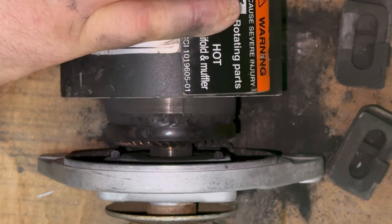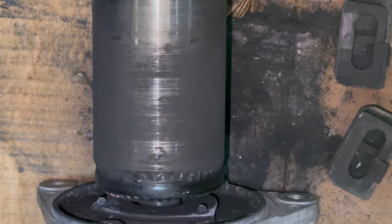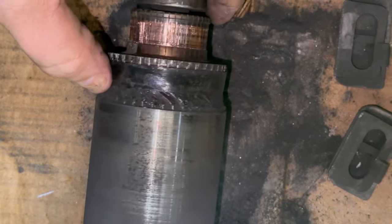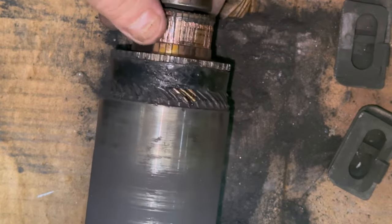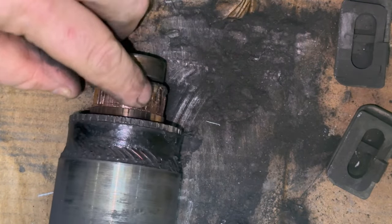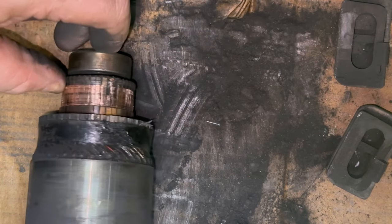Oh yeah. Oh yeah, she's toasty. Look at all that melted windings. I put an adjustable wrench on here to try to hold this pulley earlier, but the reason that these armatures fail is it starts getting hot and wore out on this commutator, and the commutator will start fusing together and just literally start shorting out right here.